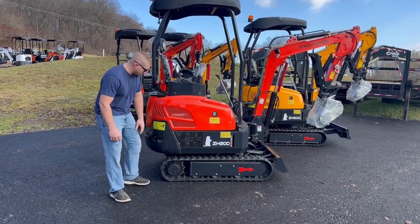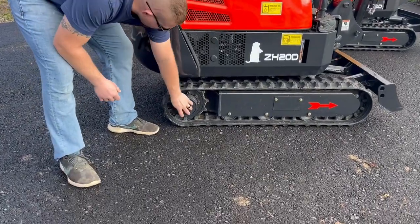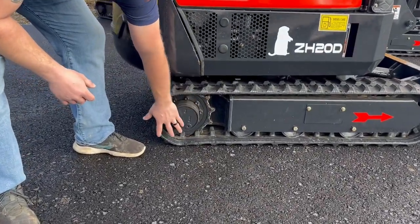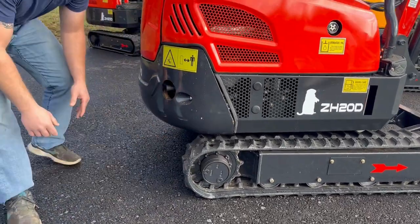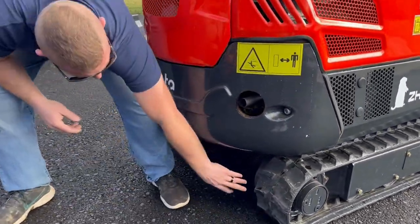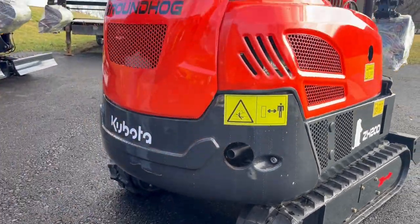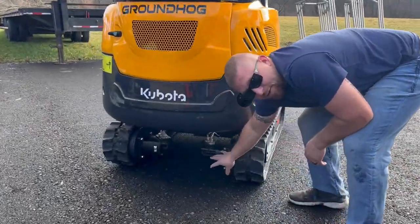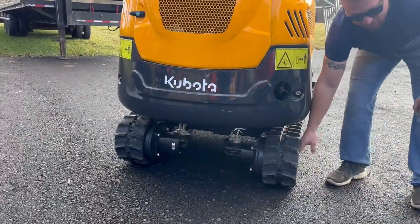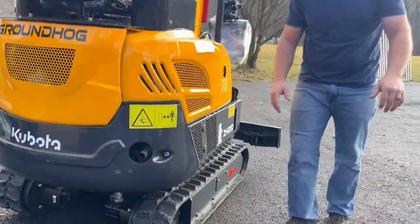The difference being the drive motors obviously, but these drive motors are going to look a lot like your bobcat drive motors. You've got your oil fill, your regular drive, and your sprocket is recessed here. So when you look on the back, your entire drive motor does not stick out the back. On a standard unit, the drive is all out here with just the drive sprocket on the end running off the spindle, where two-speed is more protected.